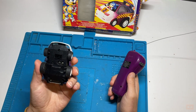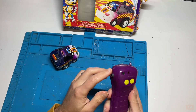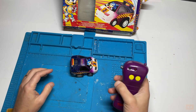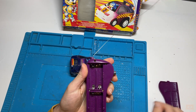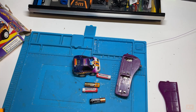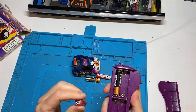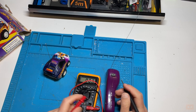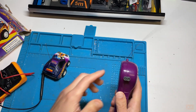The base says 1990, the box says 1992, so we'd go with 92. Inside we've got the turning mechanism where the wheels move in opposite directions - that activates turning, and it also goes forward. It says don't use nickel cadmium batteries, open by pushing down - looks like we need four double-A's. The voltages read 1.47 and above so they'll all be fine. Green must mean ready to charge - we're expecting six volts coming out and we're reading 4.5 to 5.76, so there's charge coming out.